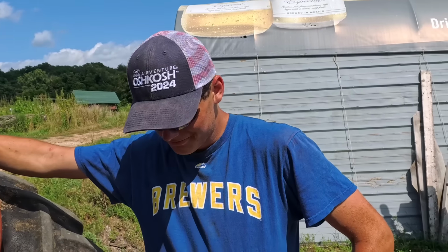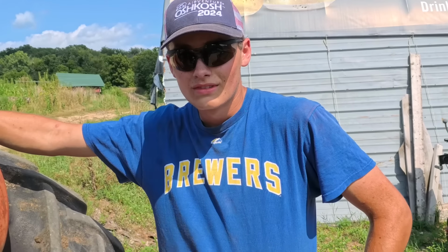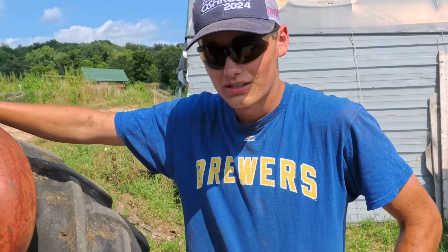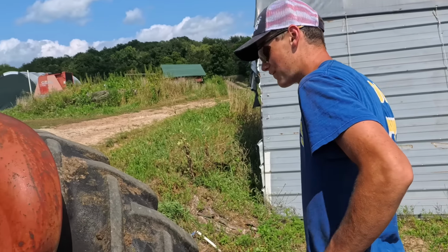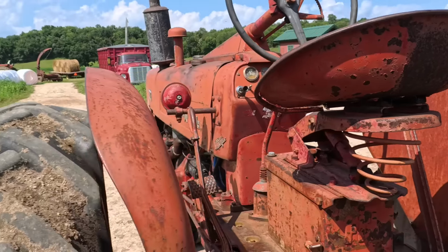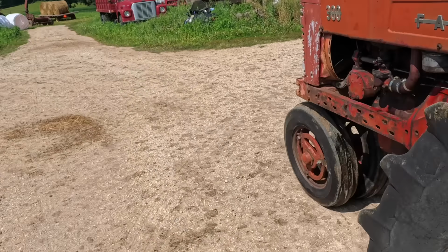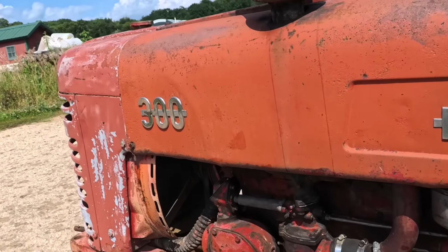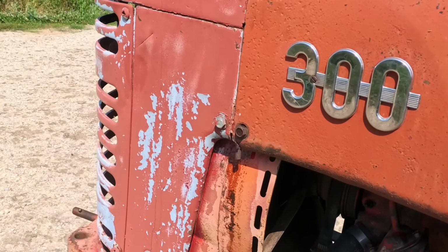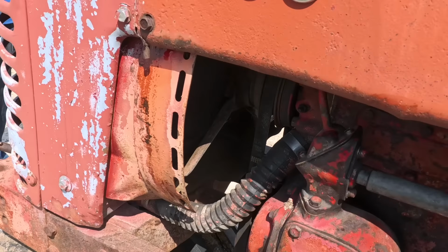So the rattle, are you convinced that's inside the muffler too? No, I can't see the fan, but I would assume. Well, if the fan was hitting, that would be constant. Yeah, I've heard a fan hit the shroud before, and that was more of a clatter rather than a tinking like that. But I'm not sure. Way to find out would be just take the muffler off.